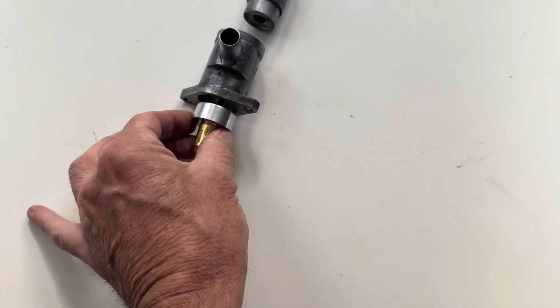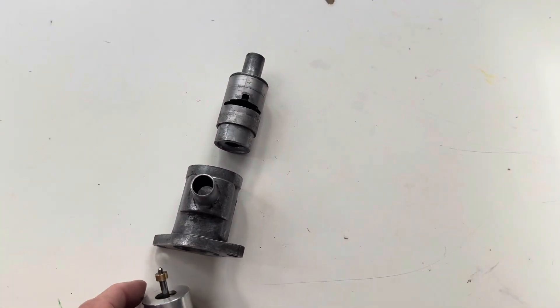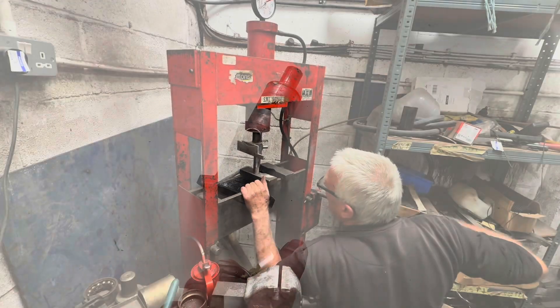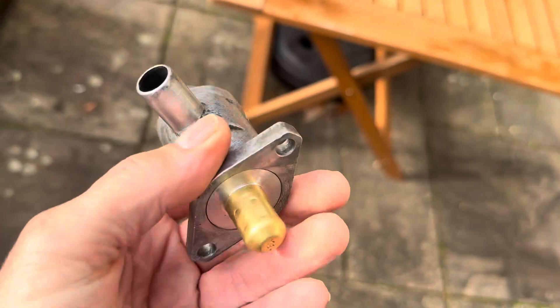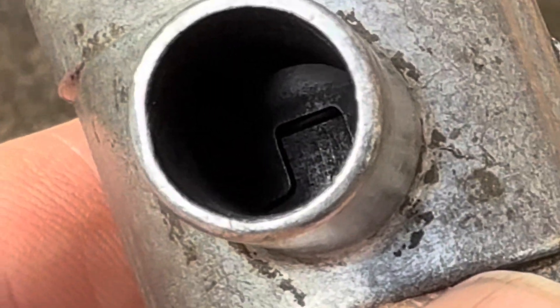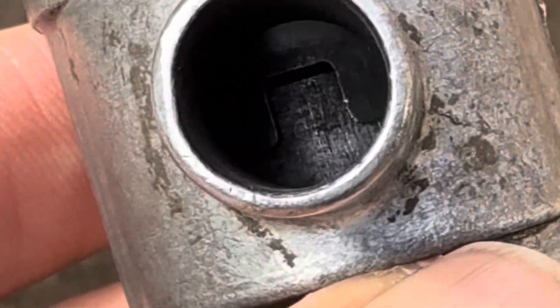Now that we've had our fitting made up it just remains to press this back in. Ideally you want to press it in this way when putting it back together — when taking it apart this comes out the other way. We just need to press the top in, bearing in mind that when you do press it in, that slot has to perfectly align with the output here. So we've pushed that in flush — now we just need to push the cylinder in. We've got this back together, and you can see what a small gap that is, so that piston does not need to move up very much to completely shut off the air going through this valve.